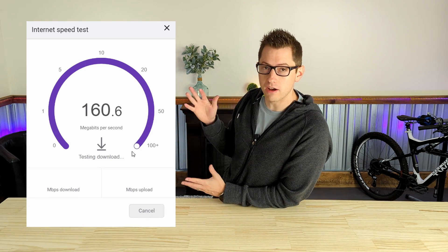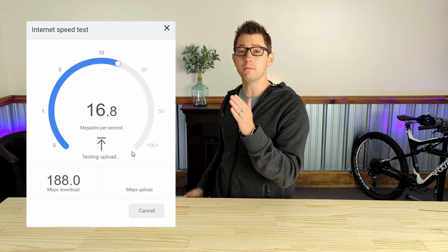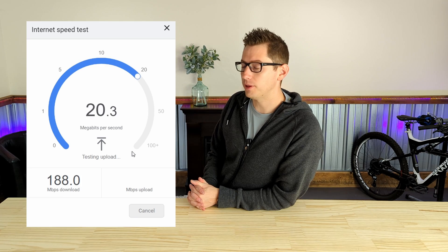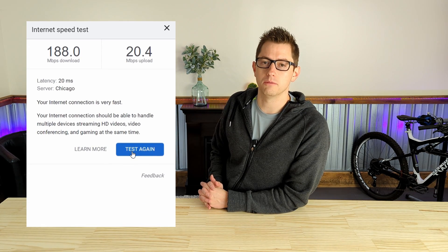Now I'm getting around 150 Mbps down — it's even spiked higher and dropped a little bit lower, but around 150 down just from that one source. It was around 20 megabit upload pretty consistently. I did play around with the antenna configuration, messing with some of the different ports on that unit, and it did seem like the recommended starting place was the best one for me. This is way better than my 40 meg down and 8 up that I was getting — super pumped about that. The latency is pretty good too, almost rock solid around 20ms. Thanks for watching me upgrade my home internet. Hopefully that means I can actually upload more YouTube videos without it bringing down my network — because yes, that was happening. Please like and subscribe if you can, it really helps out the channel. Let me know what sort of things you want to see next. I'll see you next time.